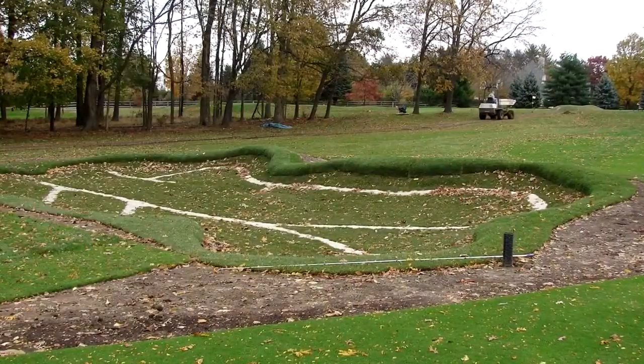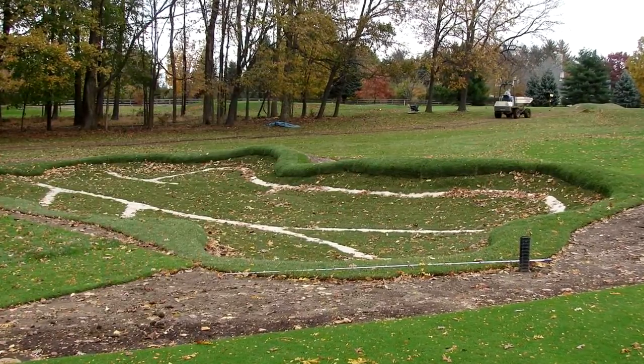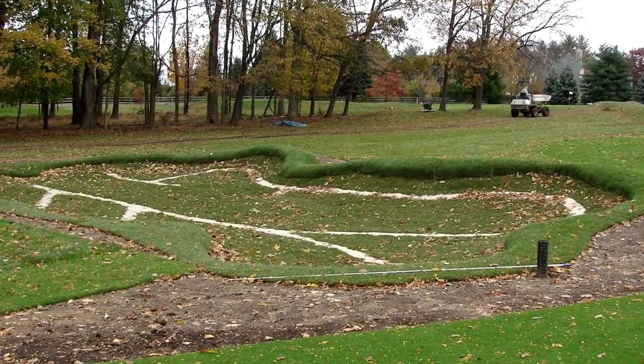So this is what we're doing. We're doing this at Country Club of Buffalo now, this coming fall. Slews of bunkers, beaucoup square feet and flash bunkers in spots, and it really is cost effective. Another thing for cost effectiveness is getting that drain line up on the sand flash portion of the bunker and across the bottom. Sometimes it may require 2 main lines running across a bunker instead of just one. And these bunkers are not dished continuously. They're flat bottom for the most part. We'll see something about that in a second.